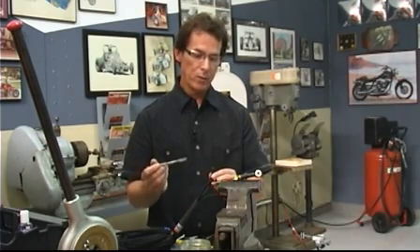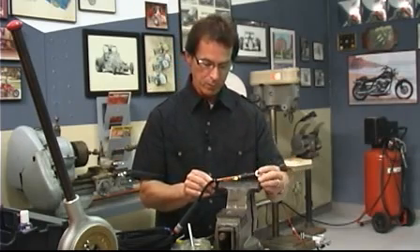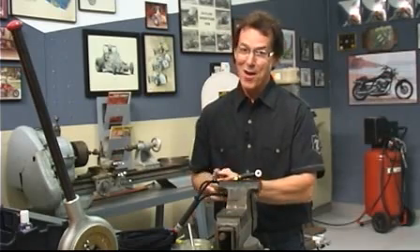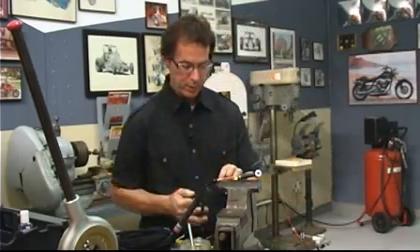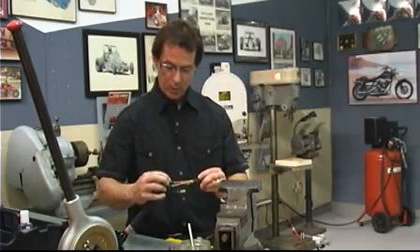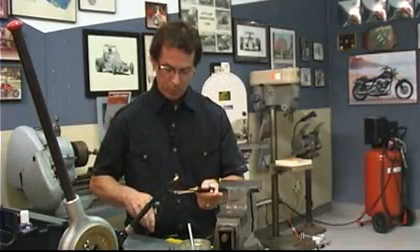On some torches the hoses are the same size, so be careful not to mix them up. Before using the torch, you definitely want to flow test it and make sure the gas line is going through the front of the torch and not water. Grab the wire tie, sink it down into the center of the fitting — on this one it's about nine rotations. Get close, give it one last pull, tighten the clamp up, cut the wire, fold it over, and remove the torch from the vise. Now you've made your two connections for water and gas. Fold the wire down tight and rotate it so it doesn't get tangled up. Same on the water hose.